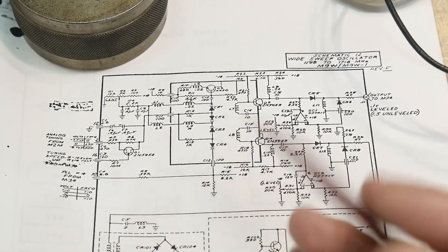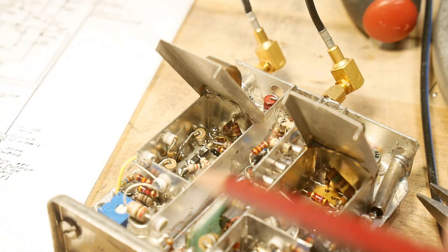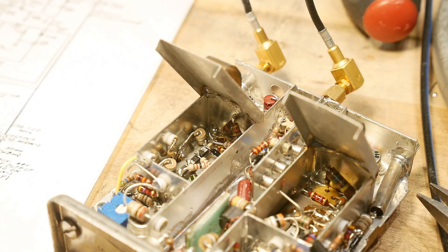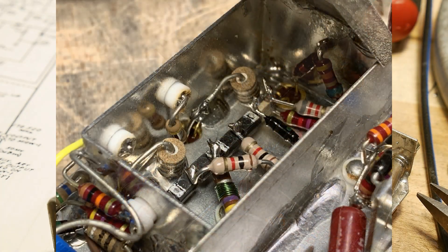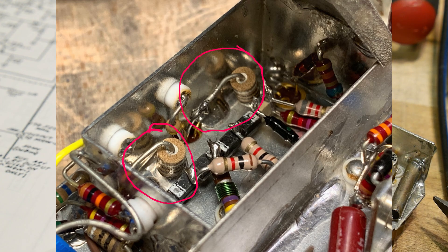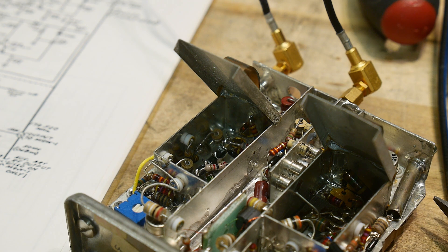These two pickup coils — how does it do that? It's in this box here. The oscillator is over this way, and the coils are over here. I'm going to take a picture and mark this up to give you an idea of what those two pickup coils are. They're just inductors — small inductors. The two circuits use the same inductor, and they both do the same thing: it tickles the base, and then that gets amplified and goes out.